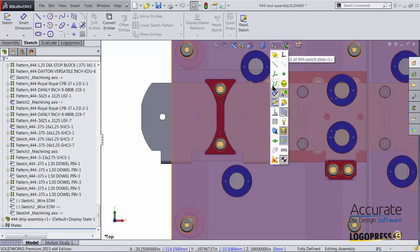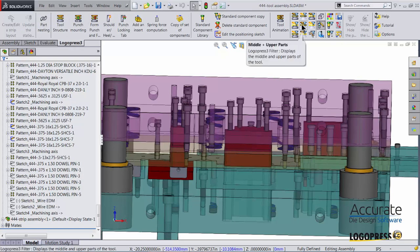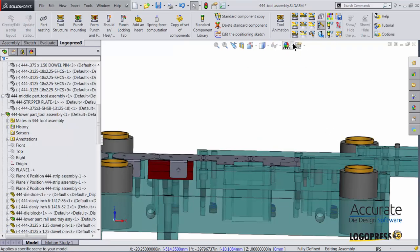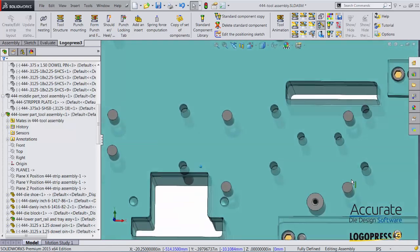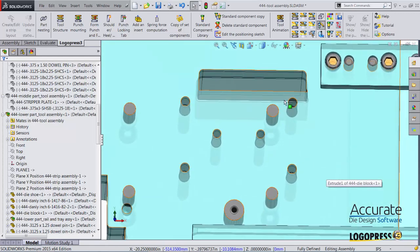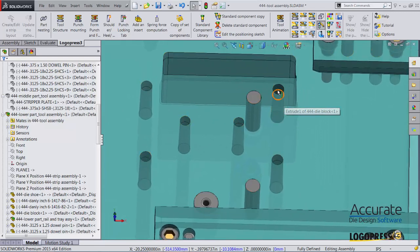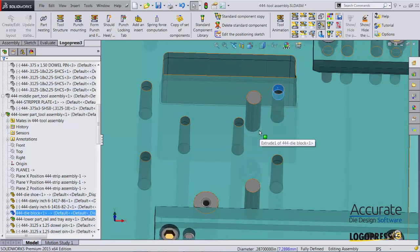Another thing that was noticed that needed to be added is that the die openings for the pierce punches are being wired in with land and taper. It was noted that we would like to have die buttons in there. So to edit those, we can either select on the punch or any hole associated with that component axis, in this case the die opening, and select Standard Component Library to edit it.